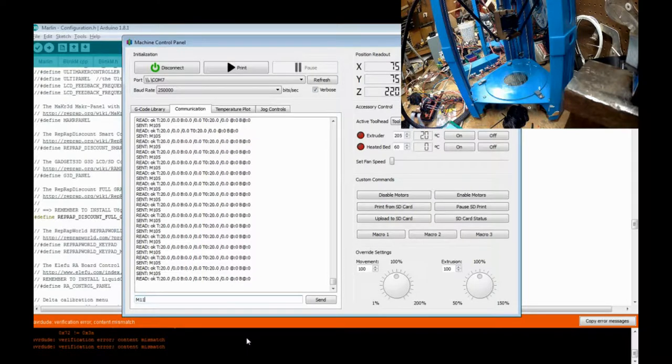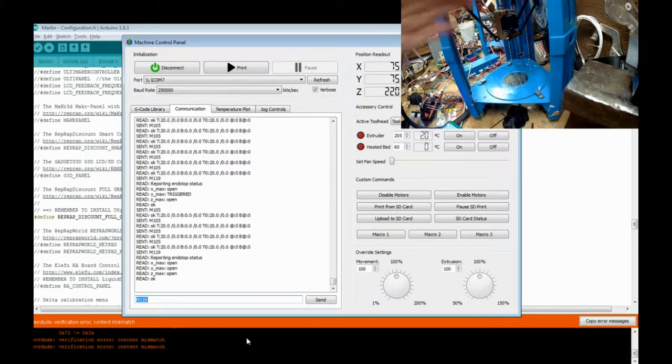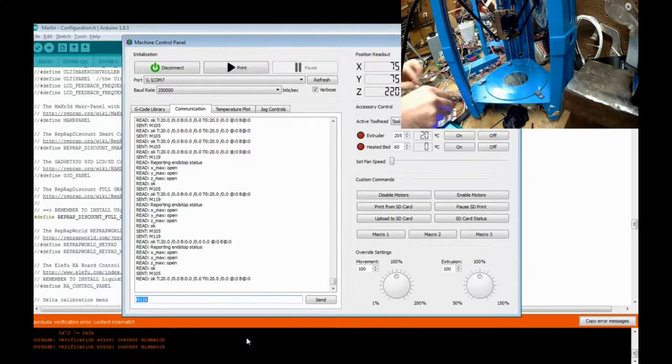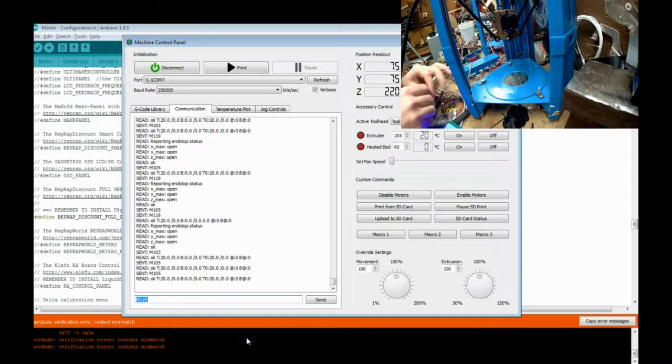One is the M119, and that is checking your end stops. So as you can see, I'm going to come in here and press an end stop with my finger. I just issued it. They showed all open, which is good. Now I have one triggered because I'm pushing it with my finger. Go through and check them all one at a time. And you might find one that's like that. Let's figure out which one. I think that's...